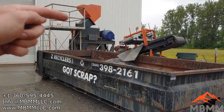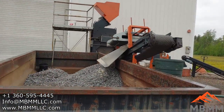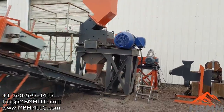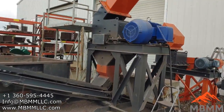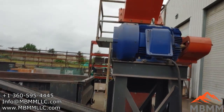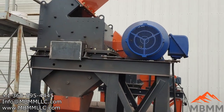And here's the machine. That's a 100 horsepower motor wired at 480 volts. And it draws about 120 amps at max load. And I was feeding that thing. We have a little amp meter that I was watching. And at idle, when it's just turning the rotor, it pulls about 45 amps. And then when you throw in a stator, it'll jump up to 100 or 110. And I was waiting until it got down to about 55 amps before I threw another motor in.